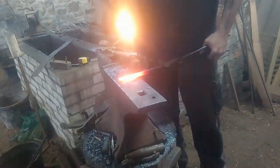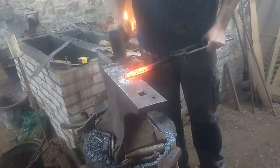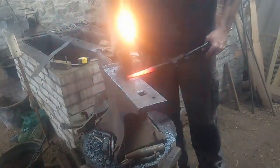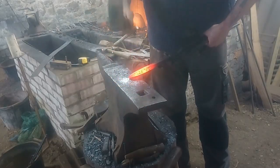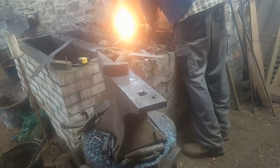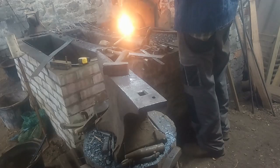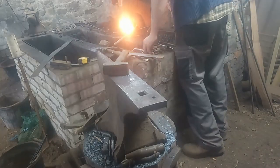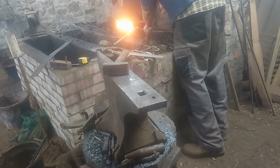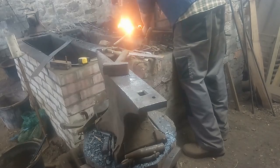Slowly flattening it out. You can't really see as much detail due to the glare of the metal — I'm sorry for that. For people learning blacksmithing: notice how I'm hammering that long section. I'm not putting it on the anvil and hammering up and down its length. I am hammering in one spot on the anvil and drawing the metal through under the hammer. Your anvil face has a different shape entirely across it, so if you place the metal over and hammer in different spots, you'll never get it even. But if you hammer in one spot and draw the metal through, you can get very cleanly forged work.